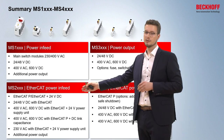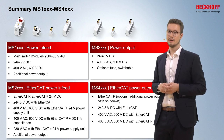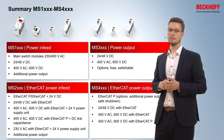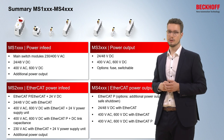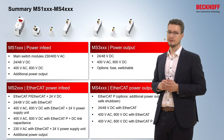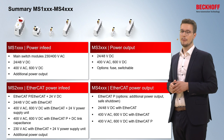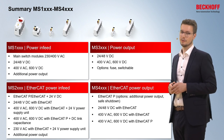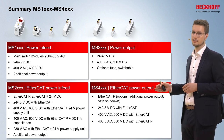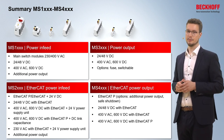The MS2 modules also combine EtherCAT — supporting both EtherCAT and EtherCATP — and there are options to use a 24V power supply within the modules, as well as additional outputs for daisy chain topologies. The MS3 modules provide power outputs: 24V, 48V, and 400/600V. And if you want to combine power output with EtherCAT, the MS4 modules provide both the voltages and EtherCAT or EtherCATP communication.